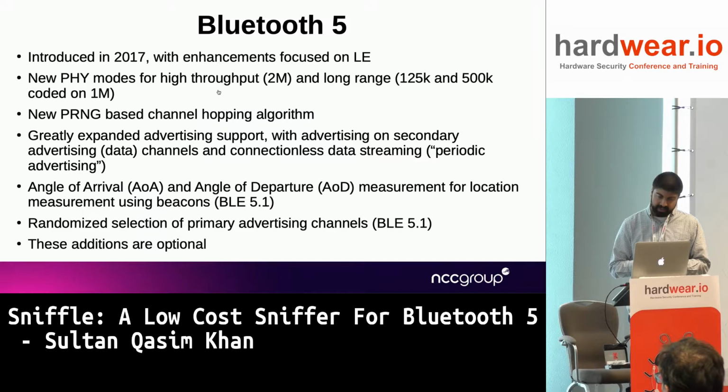So what they did in Bluetooth 5 is they allowed very short advertisements to be sent on the 3 primary advertising channels that point to a data channel, that's channels 0 to 36, and you can transmit a much larger piece of data on one of these data channels without hogging the shared primary advertising channels. There's also a new process for establishing a connection on these data channels instead of doing it on the primary channels that tend to be very crowded.